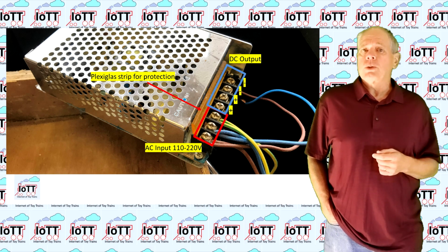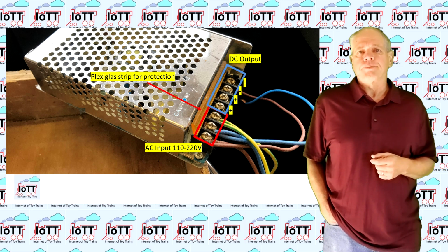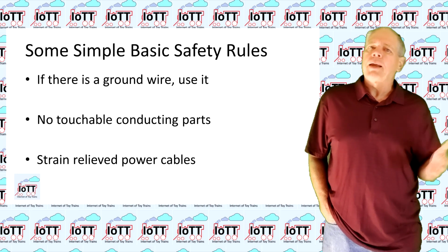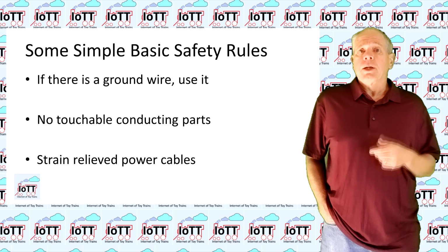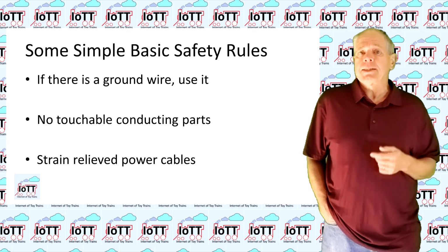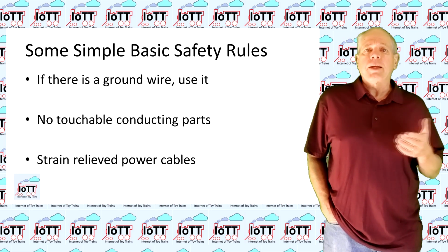If a wire comes loose, it can create a short circuit or cause a fire, or you or your granddaughter can get electrocuted. And third, make sure it stays that way even if somebody pulls on the cable or the power supply falls down from the layout. Or it falls down and somebody grabs the cable to prevent it from hitting the ground hard. In other words, always use an enclosure that can take some serious hits, is firmly closed with screws that cannot just break out, and there is a good strain relief mechanism on the cable.